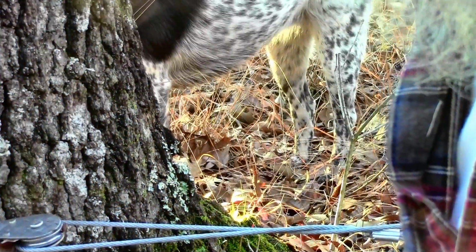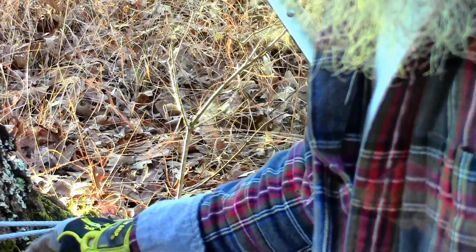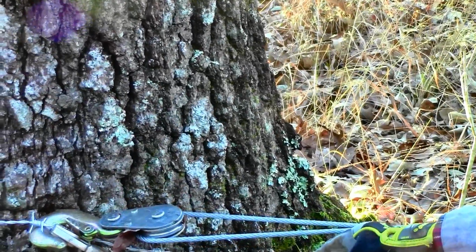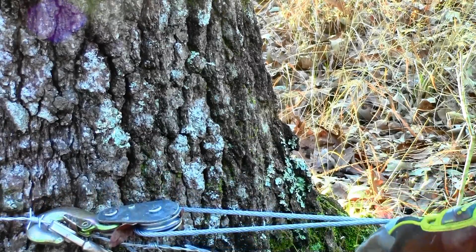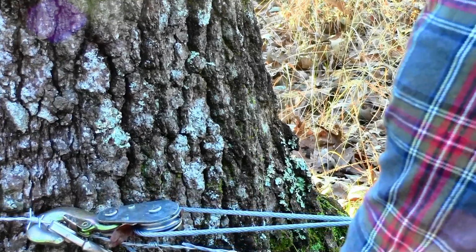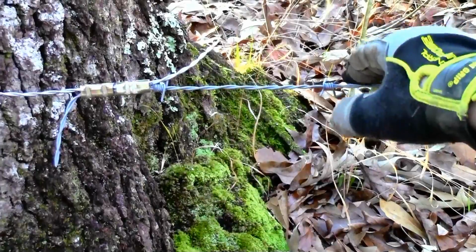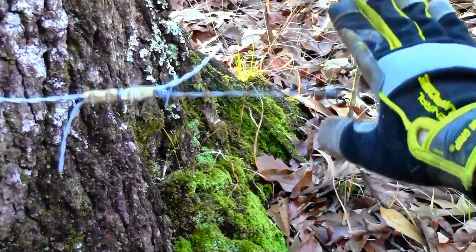So we put our come along on there, same that we've been doing. Vice grips on either wire. There we go. So vice grips, come along, wire straight, give it a good stretch, really snug it down. And then our 2 ferrules there. Make sure it's as tight as we can get it. And then there it is, 2 ferrules, double crimped. On the come along, holding it in place, and look at, boy, that's like a guitar string, nice and tight. Bing, bing, bing, bing, bing.